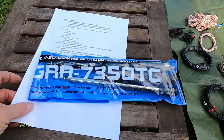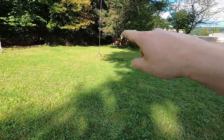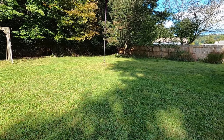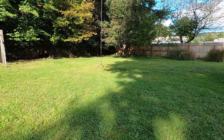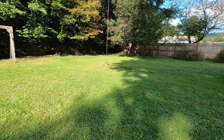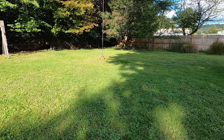If you're going to run a vertical, keep in mind it may take some messing around with to get it how you want it — you're going to have to play with your radial fields. I have never played with window screen ground planes for these things yet. The reason I haven't is most of the time these are going in a backpack and going out in the woods. A huge piece of window screen rolls up massive — it doesn't weigh anything, but it's huge and it's hard to pack. If I'm doing an activation next to my vehicle, I might throw the window screen on the ground, alligator clip from there to the base of the antenna, and you're good to go. But this radial field here — these 12 radials — packs down pretty small and they're very light, so for a backpack this works better. A window screen only takes up maybe four by eight; this thing takes up 36 feet.